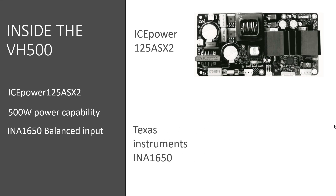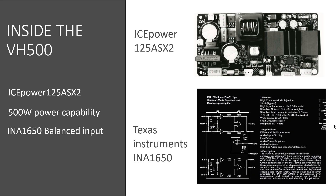Balanced preamplifier: the preamplifier is a critical power amplifier component with high impact on sound quality, often neglected by designers. Our design uses the latest generation Texas Instruments INA1650 chip. The most important symmetrical input components are integrated in the chip and made by a single lithography process, achieving component accuracy of 0.05%, which is not possible with discrete designs.